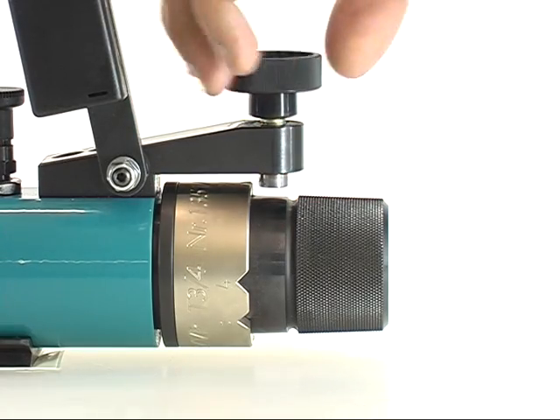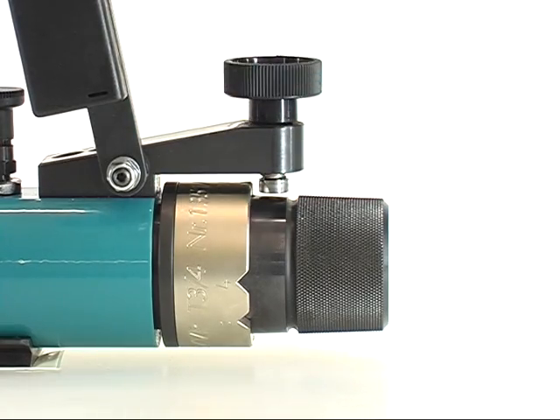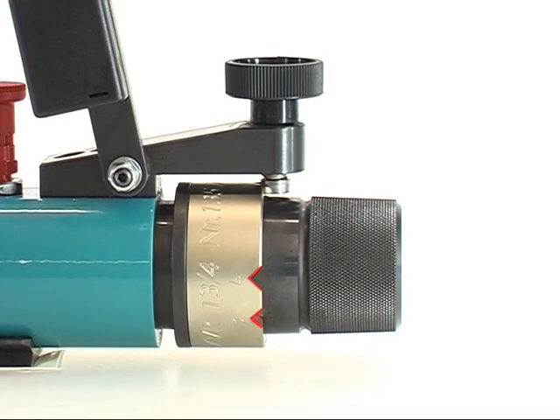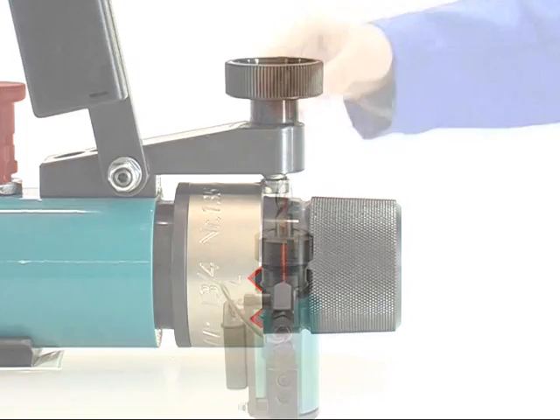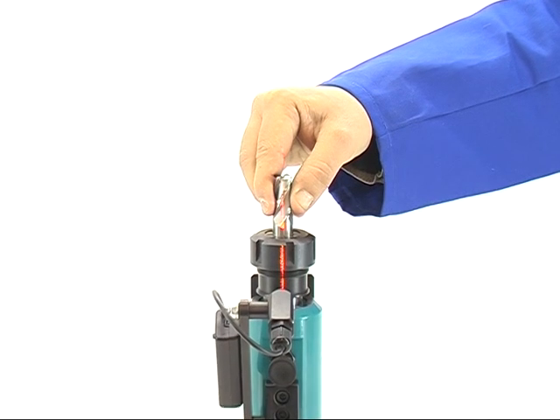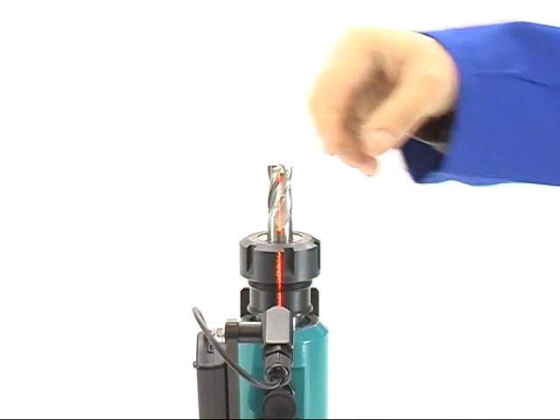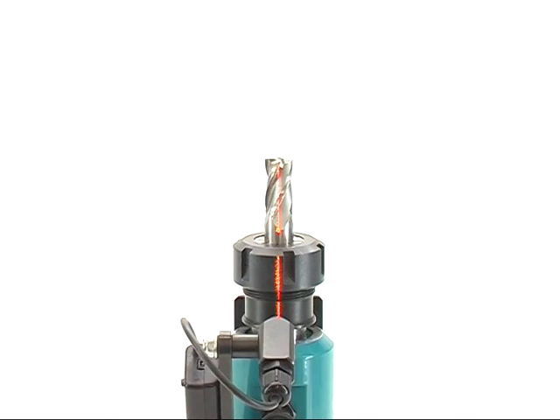Carry out the alignment this way. Unlock the grid pin so that the pressure bearing locks inside the corresponding index notch. Now align the milling cutter such that the cutting edge is in true alignment to the adjusting laser. Lock the milling cutter at this position.